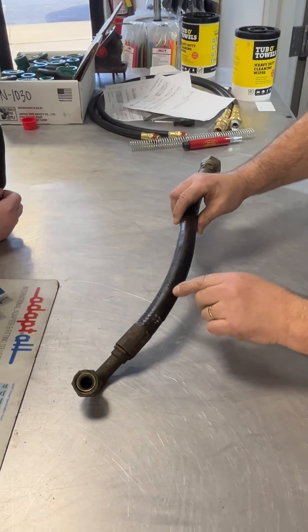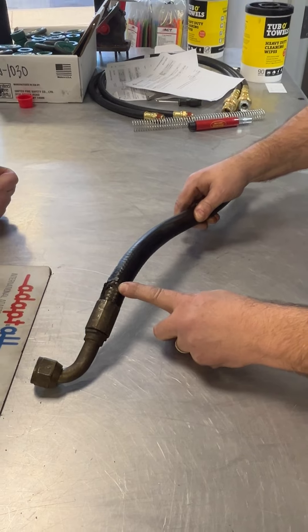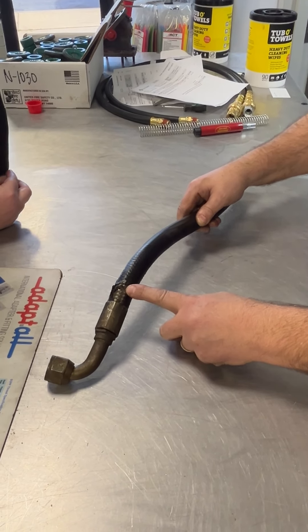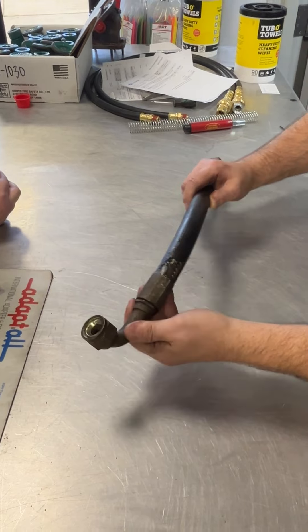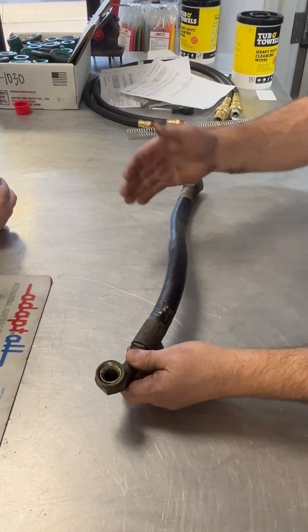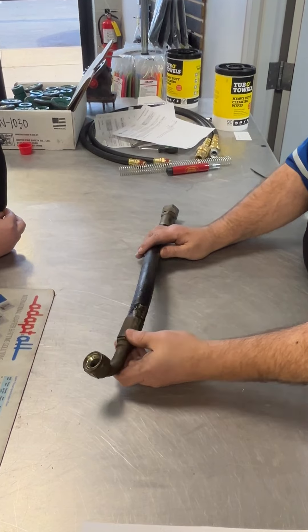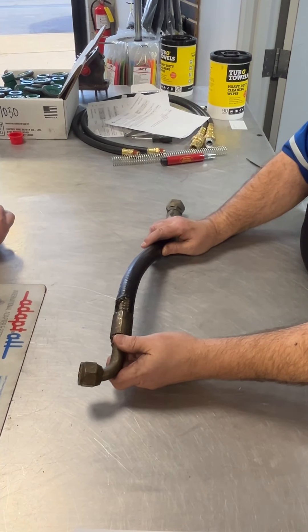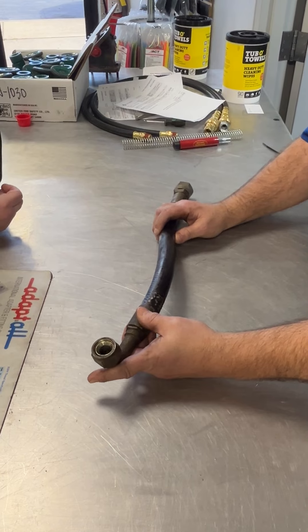I also see heat cracks in the external cover. And if you evaluate the blowout here, you can see that it blew from inside out, which most likely came from heat. Then we start to ask the customer if he's having heat issues, what's the proper application, things of that nature — just to make sure we put the proper hose back on there, even if it's been replaced wrong in the past.